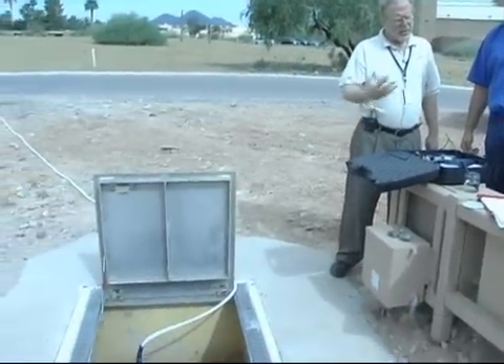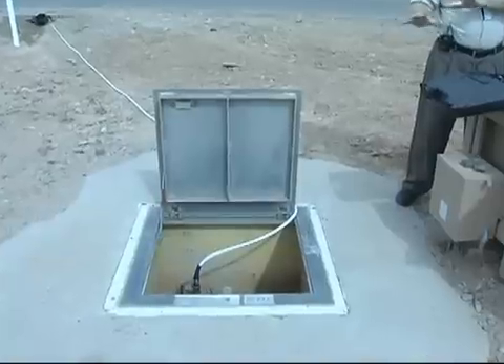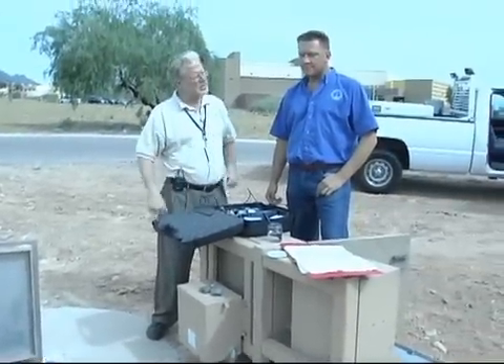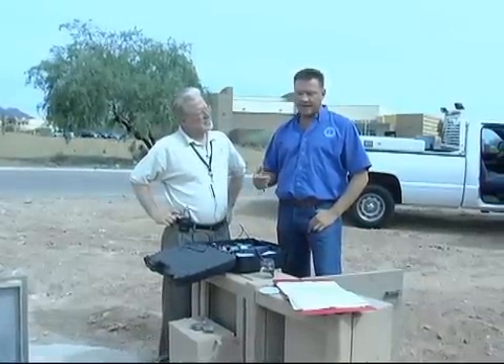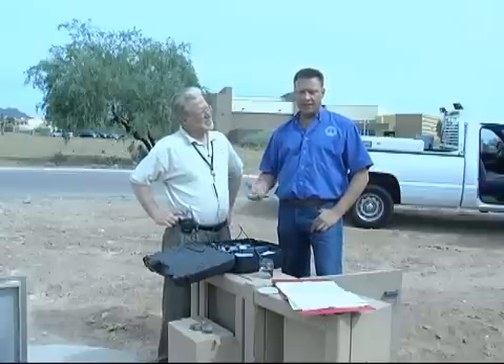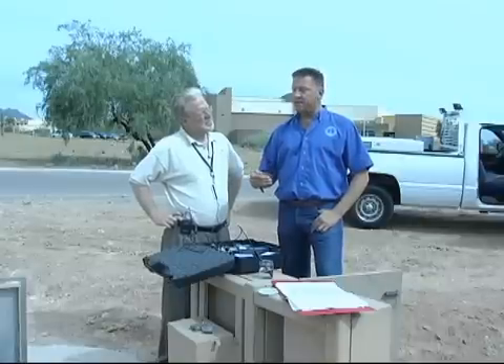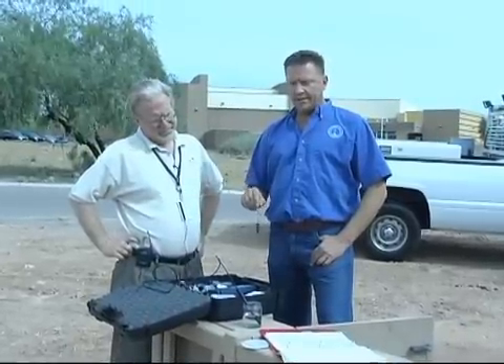You can see here that we've got the well set up. Can you explain how you make sure that you're representative in how you're sampling so that your final reading is going to be consistent and represent what's in this well? Initially, when we come out and are ready to do our sampling, we'll first take a water level read. Depending on your well, you may have a data logger or you have to manually tape it, but you need that initial well depth so that you're able to calculate your three well volumes purge. We'll take that read and log it at the time that we begin the purge. From there, we'll calculate three well volumes, which will give us the amount of time it's going to take.